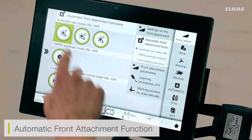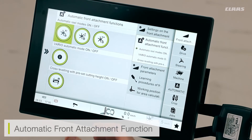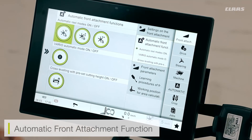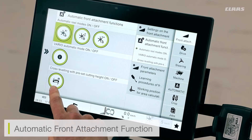I also have a reel speed adjustment so the faster I am cutting in my Lexion the faster my reel will go, and the slower I'm cutting the slower my reel will go. These can be enabled or disabled by pressing the button — if it's green it's enabled, if it's gray it's disengaged. My Vario automatics work the same way as my reel automatics: if I have a saved position for my Vario table I can save that Vario setting and, as I press my auto contour button, that's going to save the mode. This also works the same way for the cross leveling adjustment.